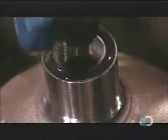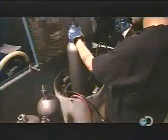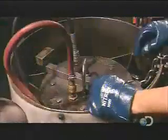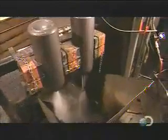They test the cylinder by filling it with water. Then they seal it off and immerse it in water. The machine then adds more water to the cylinder and gauges how well it withstands the extra pressure. They rinse the inside with hot water, then dry and clean it by blowing in some purified air.